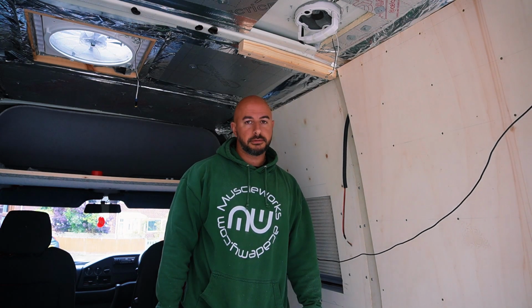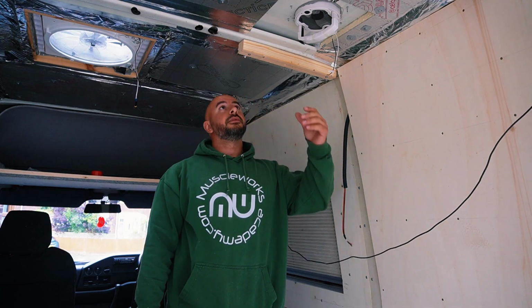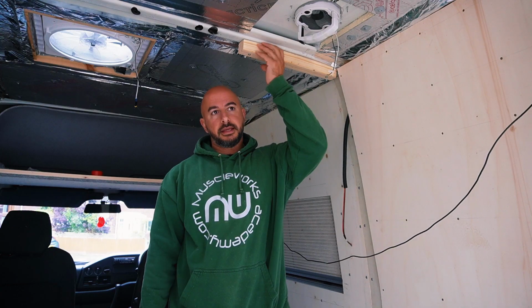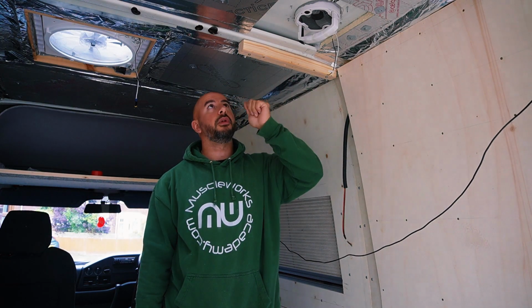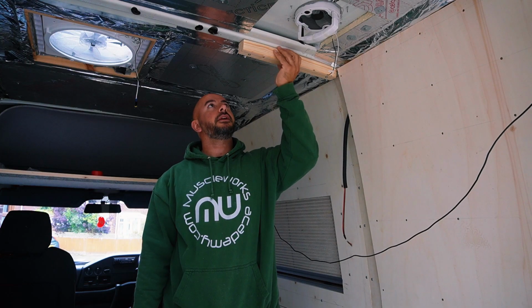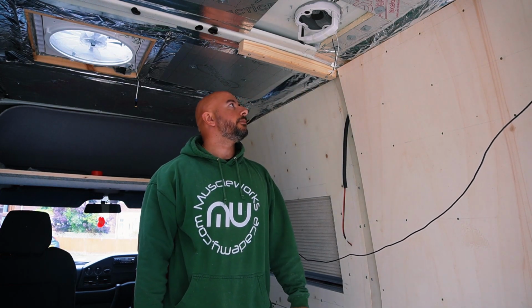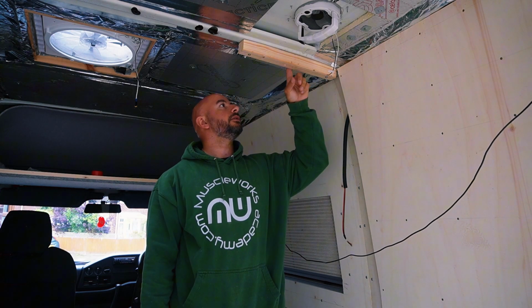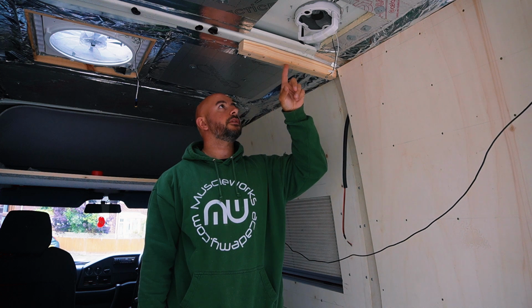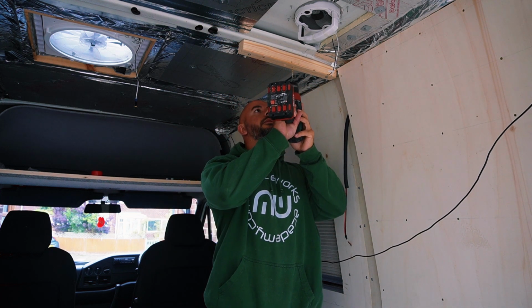After snapping 2 screws, I've realised what the mistake was that I was doing, was that the pilot hole I drilled in the metal was too small for the screws. I did not think about that, I just drilled a small hole. So I have drilled a correct size pilot hole, and now we should be able to screw in. I've tested it and it does work. I've got one more pilot hole to drill, because I've had to move that because I've got a thread stuck in the wood. So new hole, hopefully this goes through and we shouldn't have any issues.